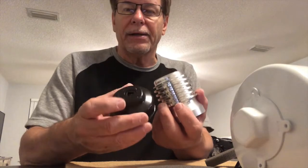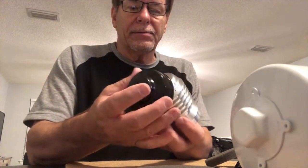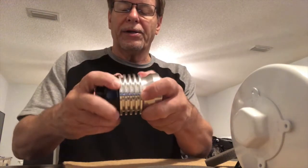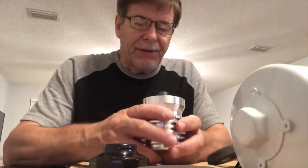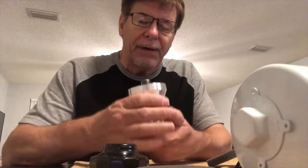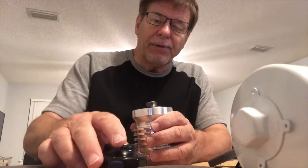This little cup here goes on the machined flat spots at the bottom — you use a 3/8 socket to put it on and torque it. You don't want to put any kind of wrench on here and mess up this pretty machined finish. I have to say, just looking at this, this is top-notch quality.